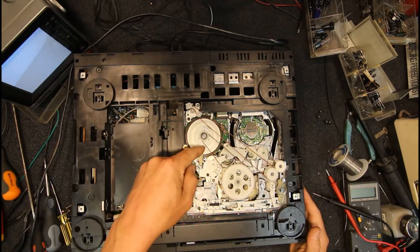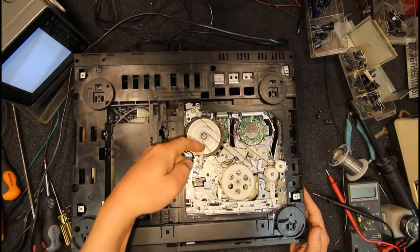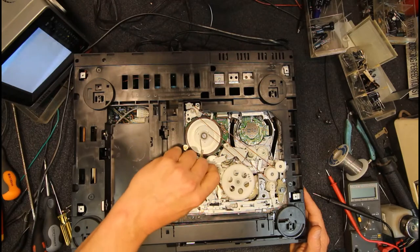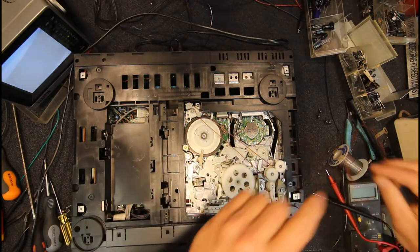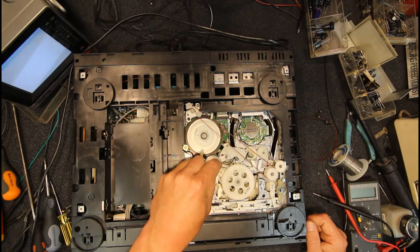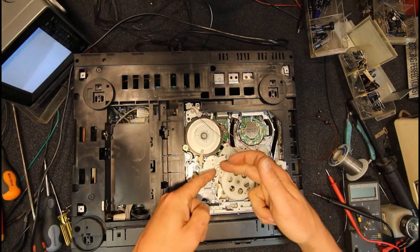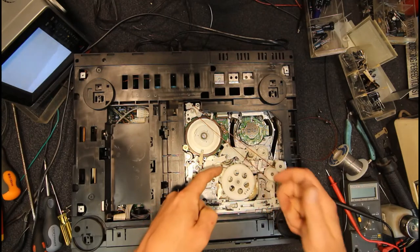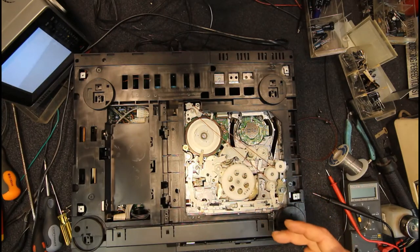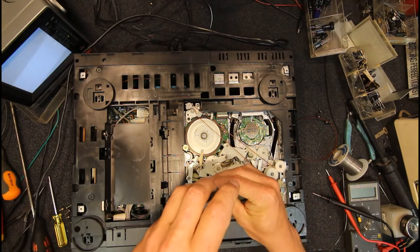Now, where is it? This little one, yeah, that's quite seized, so it might be a chance to take this belt off, it just comes off like that. These pulleys do wear out a bit. This one's actually got quite a bit of play in it because the belt's pushing it against it. It tends to wear out around this pin, so that's not perfect, but it didn't seem to worry him too much. Then we've got a screw here